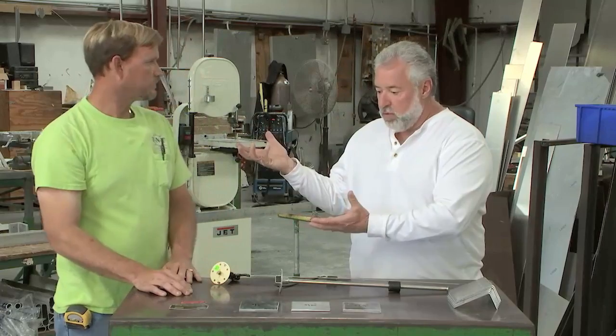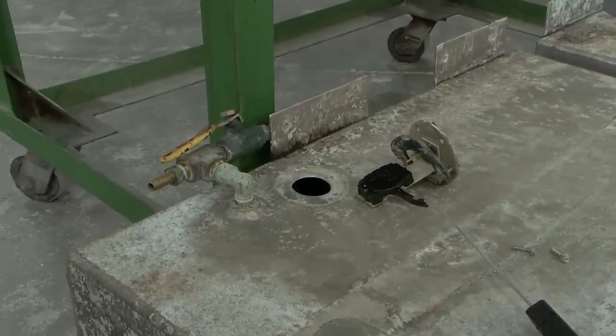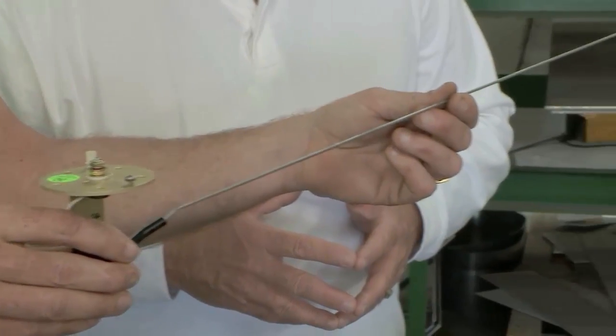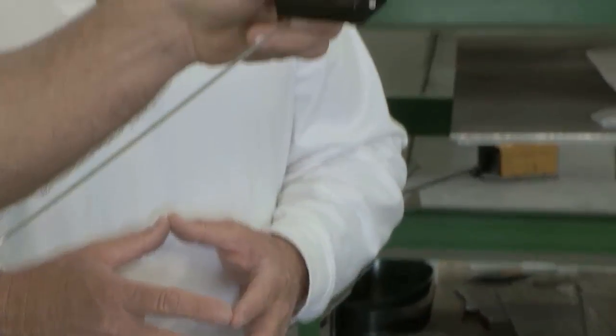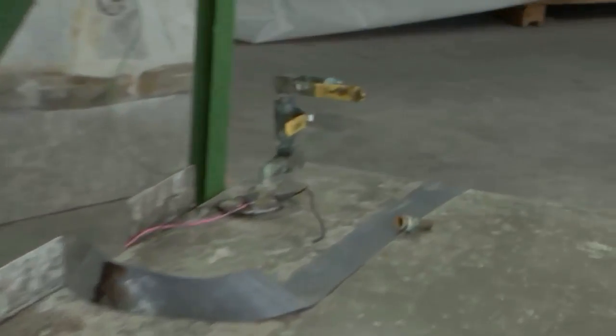We did not have time last go around when you were on the show to talk about sending units. Take a look at where our sending units are located on the tank. What are the different sending units that you have available for consumers? Well, we have this one here, which is a typical Rochester arm sender, swings up and down. Been in the industry for years. This cork slides onto the end, we bend the rod over, and now we have a sender that swings up when it's full, down when it's empty. And they do last a good long time. Very reliable gauge. Our tank from the AquaSport was about 30 years old, and this one's maybe a quarter of a century, still working. What's this next one?